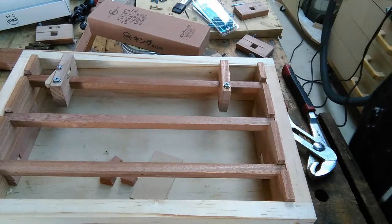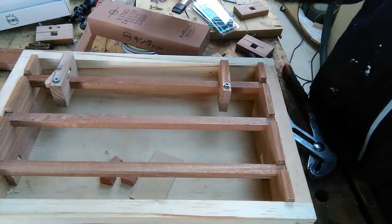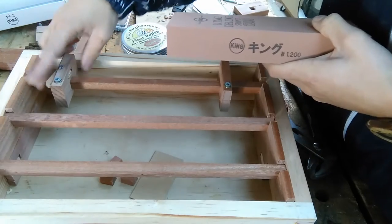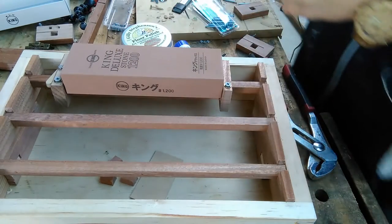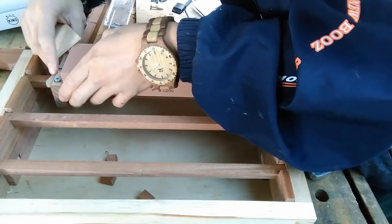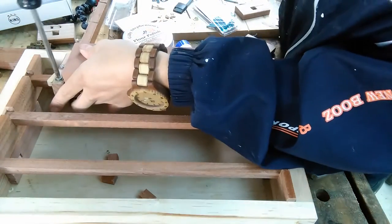So it turned out the wing nut and the bolt configuration wasn't actually strong enough to hold the jaws in place, and it just slipped when I pulled the cam backwards. So now with screws, I'm gonna try it again, and this time with a piece of MDF at the moving jaw to help reduce wear on the wedge.